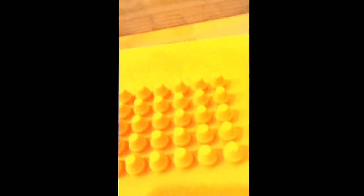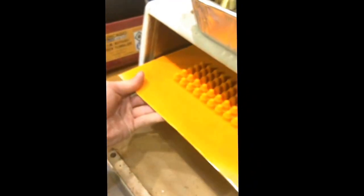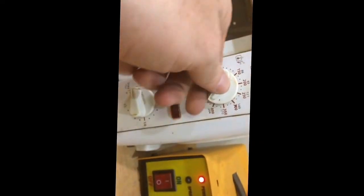Those are completely coated. I turn off my air, take the little electrode off, and open up my toaster door - nice and careful. Don't ruin your oven at the house because this stuff gets everywhere and will bake onto everything, and good luck getting it off. Now that they're in there, turn it to 400 degrees and crank that sucker all the way over.